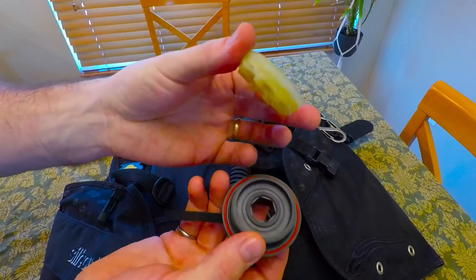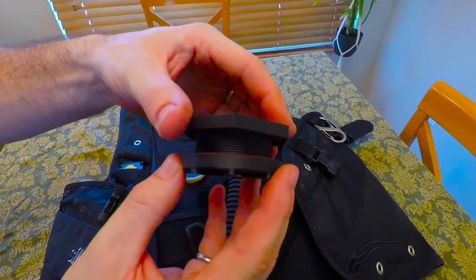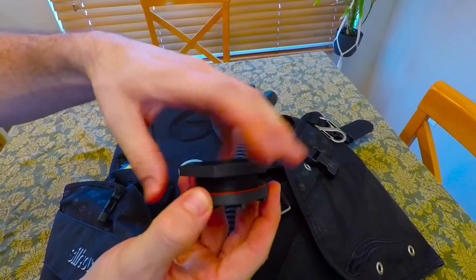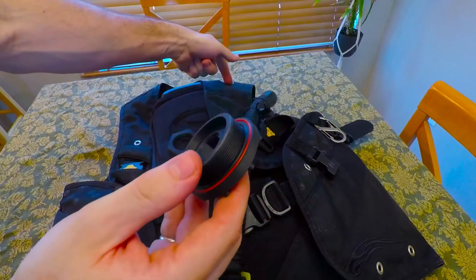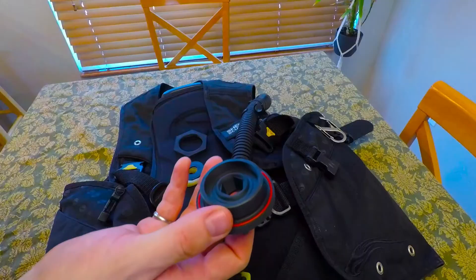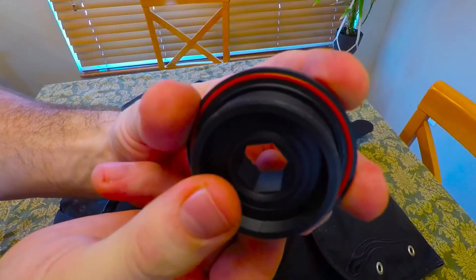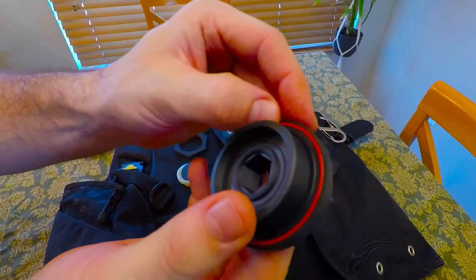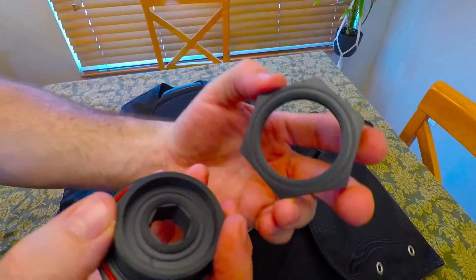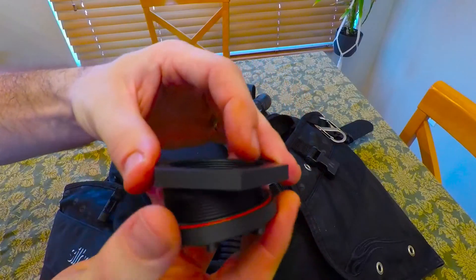So I made this — and we're going to get a little closer to the camera so you can get a better view. This is my replacement for Sherwood's planned obsolescence bladder fitting that they glue on here. One key difference: it's not going to be glued in place. Those of you who do regular plumbing will recognize this as effectively a through-wall fitting. This bottom piece goes into the hole in the bladder just like the old one did, and then this nut screws down on top to clamp it in place. It has dual seals — one black O-ring and one red O-ring — giving me redundant seals. On the nut there's a protrusion that matches where the seals are, so we get really good compression.